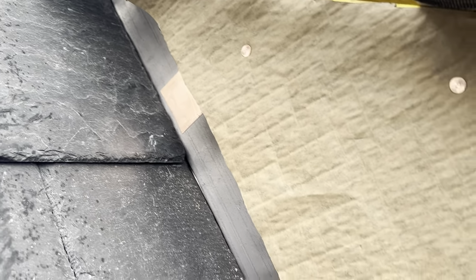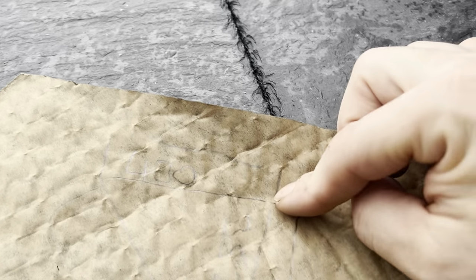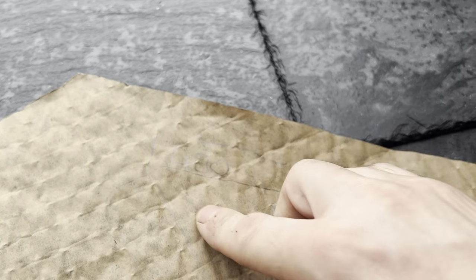And then I measure all the way along the top there, from that point there, all the way until it reaches the batten again. Just into that corner. And in that case, it was 430. So we know that measurement's an inch in, going back to that corner. And then I just need to allow an extra 25mm, the welt that turns down behind that copper. So now we've got the measurements, let's go down to the bench and knock that up.